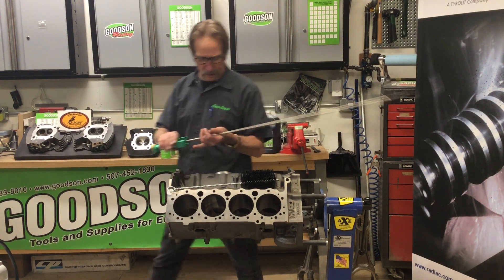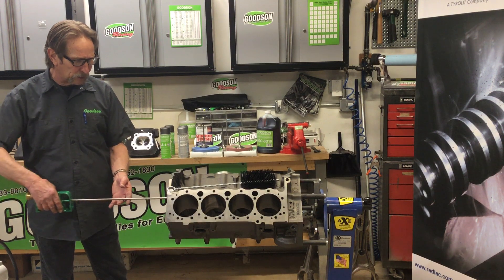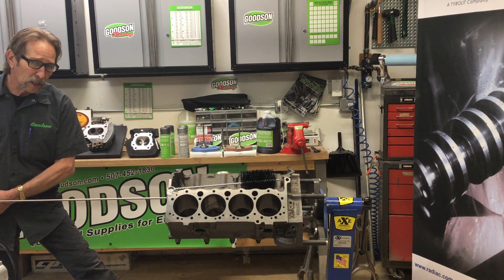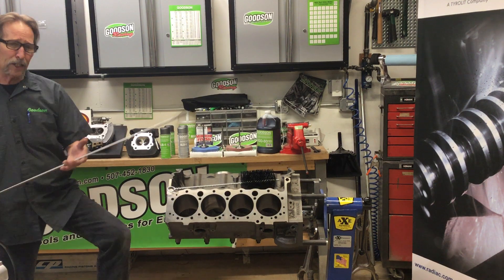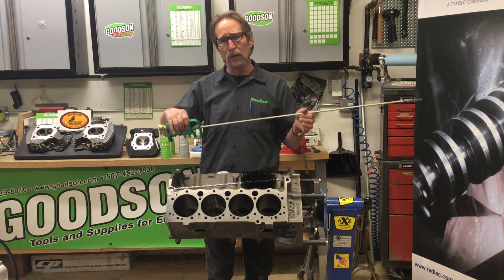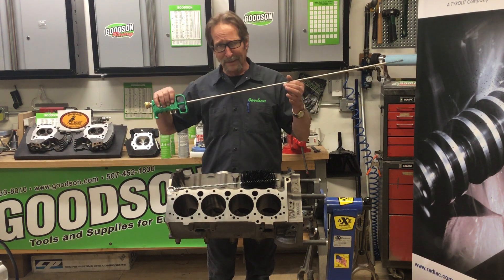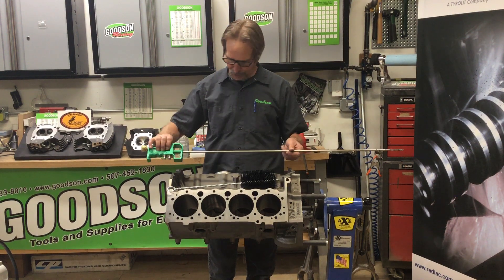Connect the water, connect the air, get to the front of the engine block, and literally just insert it — press water, press air, then aggressively move back and forth using air separately, water separately, or both simultaneously. We actually cut out quite a bit of time when it comes to cleaning those oil galleys. It's a one-shot tool versus the old brush, air, water, air, brush cycle. All that combination is now in one nice tool.